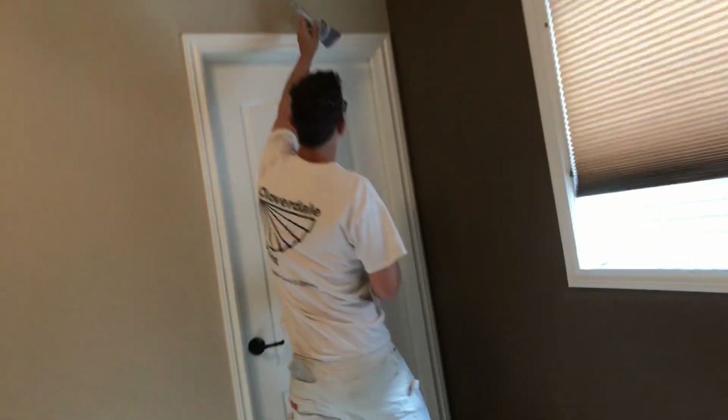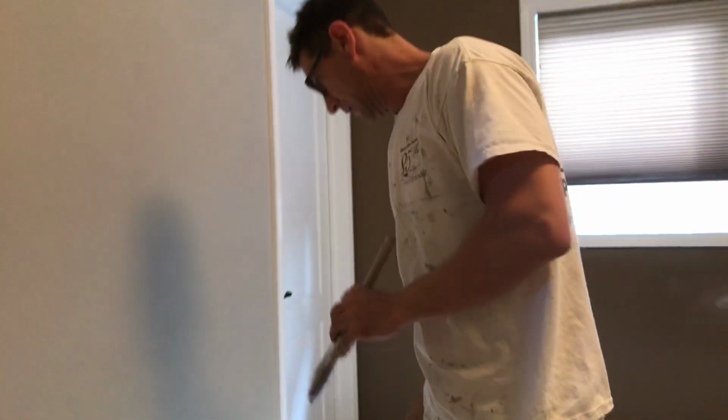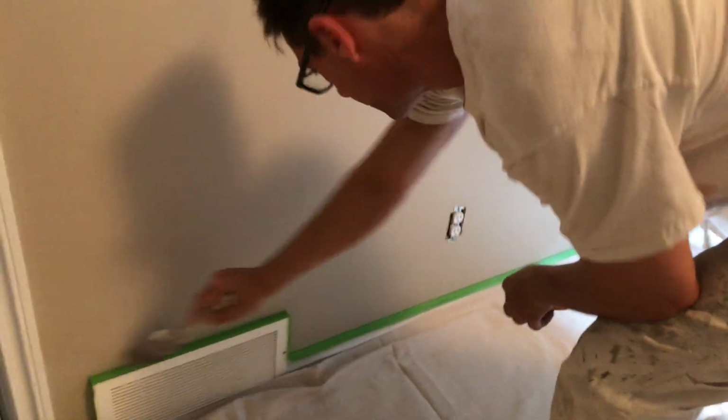And then, since there's dust right here, you want to get that off, so you want to dust that off. Dust this one. Dust is a painter's worst enemy because dust will make your walls super rough. So now we'll definitely want to spot prime these when we're rolling this wall. So we'll brush out our dust. Oh, there we got this one. Okay, over here.